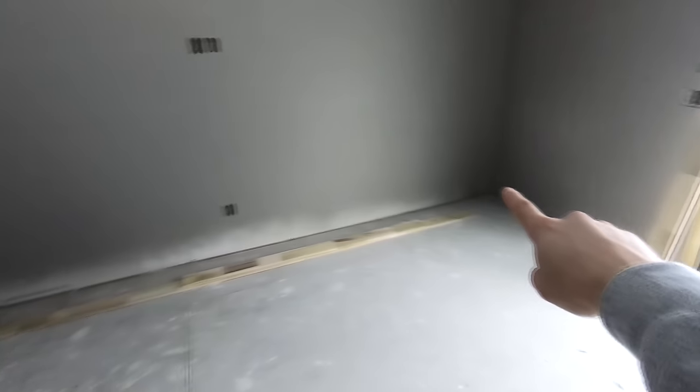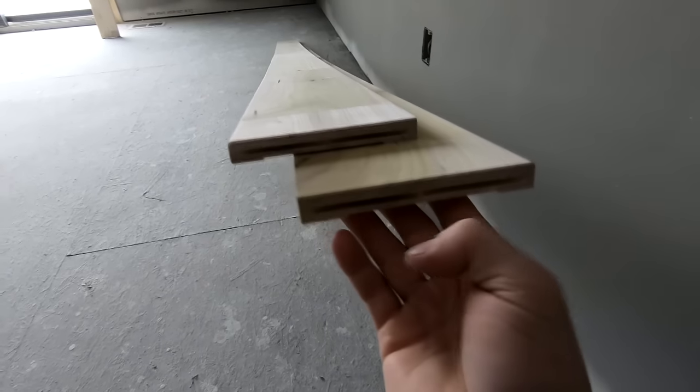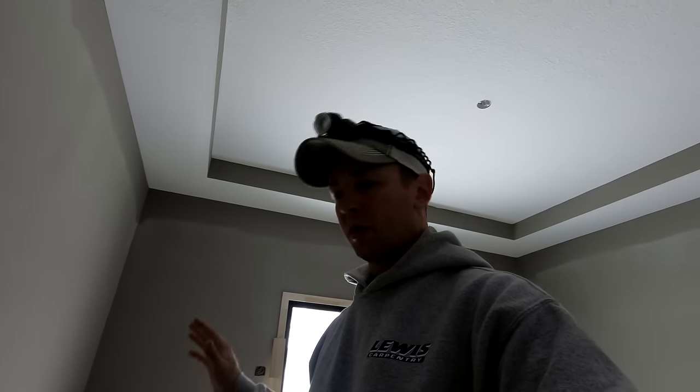Over here this wall and this wall are over 16 feet long, so when that happens I biscuit a splice in the center, butt join it, cut it a little bit long and snap it together. With a long wall — let's say it was 249 inches — I'll count one piece at 100 inches, subtract that off of 249, and my next piece is 149 inches. I could cut a 100 inch piece and then cut the remaining on the next piece, biscuit the two ends, and it's really simple. That way you're not losing your workflow — just take the long measurement with your laser and cut both pieces at the saw like you do the rest.